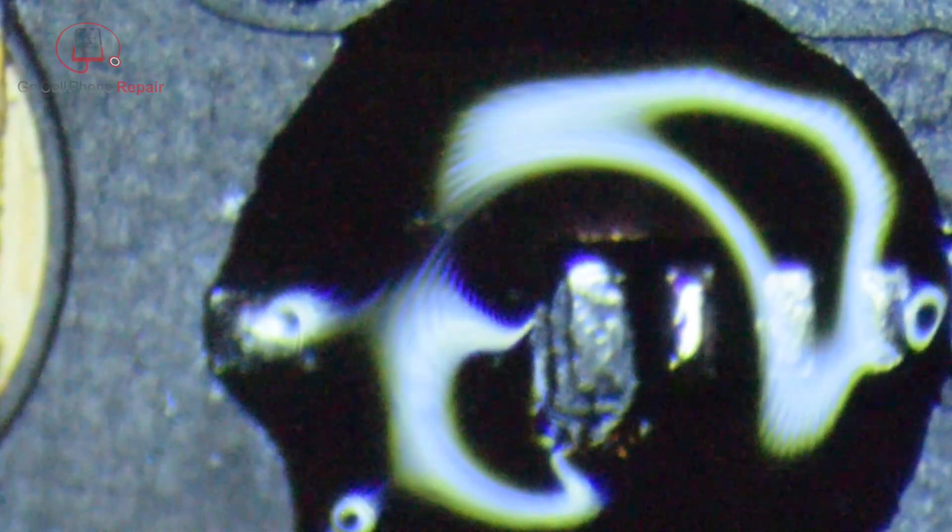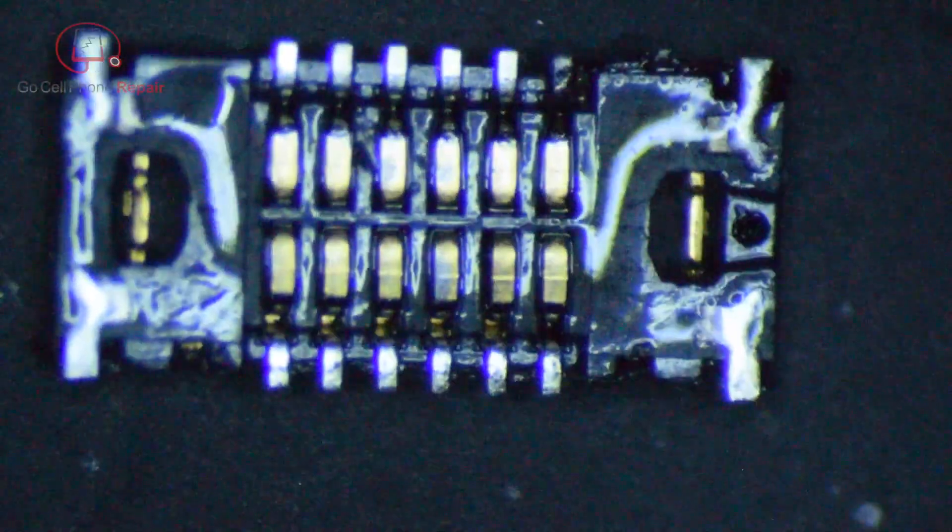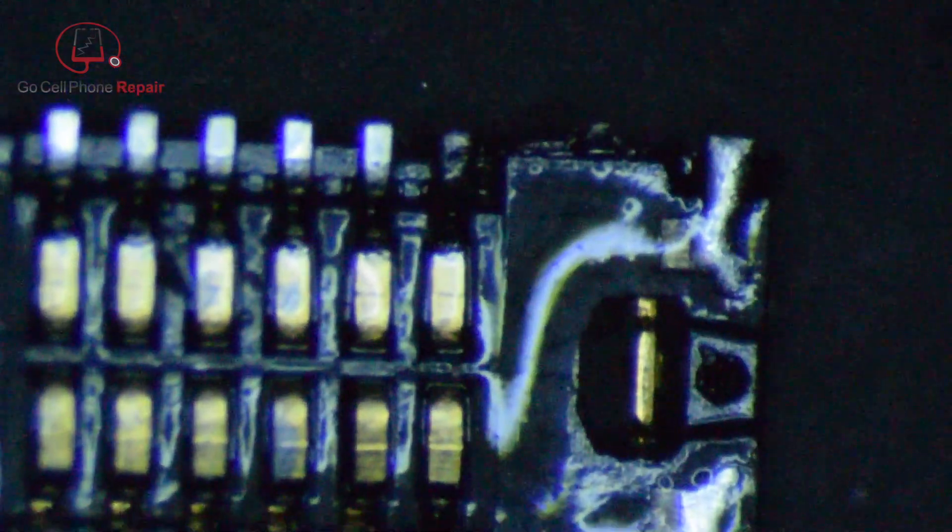The problem I was running into in the beginning is nothing really wanted to stick because there was so much oxidation on there — that's the big problem when you're trying to get things to bond. Going in again with a bit of solder, adding it and cleaning it up. We're starting to see the pad reveal itself. Looking at the old connector that came off, you can see the corrosion was not only on the board but on the connector itself. I might be able to scrape that clean, but this thing's already warped and melted, and we have something to replace it with anyway, so that's going in the trash.